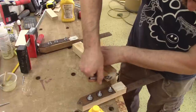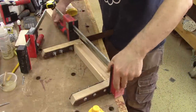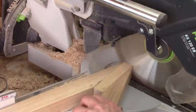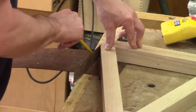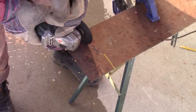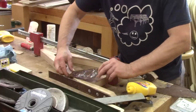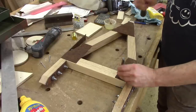Again, I need to wait for the glue to dry. I use this opportunity to glue the rest together — since I need to wait for one glue-up to dry, two won't make any difference. When the glue is dry enough, I cut the tip and trace the shape of all the gullets and cut them. Just like last time, I epoxy them in place and wait for the epoxy to cure before drilling the holes.